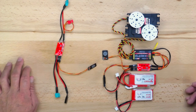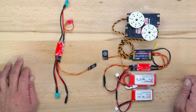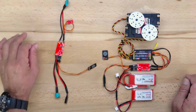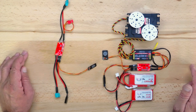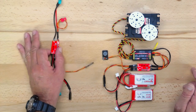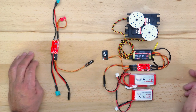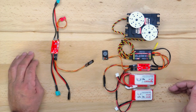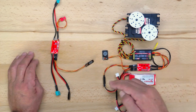If you're using an electric power system with an ESC that has a very large BEC and you're nervous about the smaller input connectors on the ESC version, you can still use the power version. You would simply run the BEC power through the unit and the signal would bypass the unit and go directly to the receiver. Signal is not passed through this unit — you'll notice there is no signal wire on the input side. On the BEC side there is a signal wire on the primary lead, and it will pass your signal all the way through, so your throttle signal passes straight through.